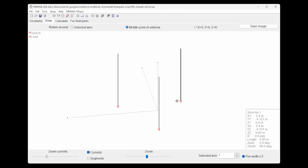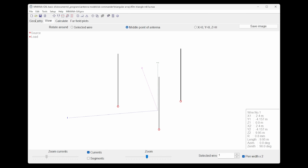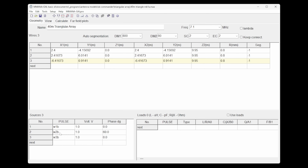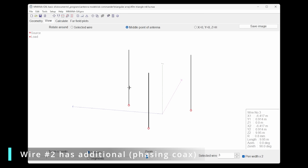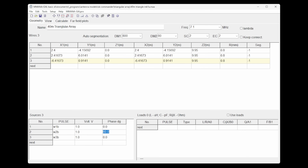You can see there are three dots at the bottom of each of the telescopic poles — bits of aluminium, whatever you've built. They're roughly a quarter wavelength spacing apart. John Gendron, when he made my triangular relay box, also made a great descriptive video — I'll find that and put a link in the description. So I've got these three verticals; they're all about 10 meters high with Y1, Y2, and Y3 coax connections at the base.